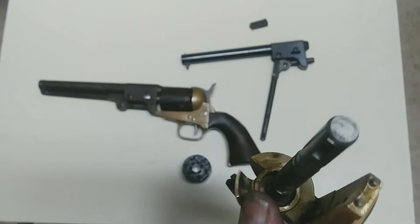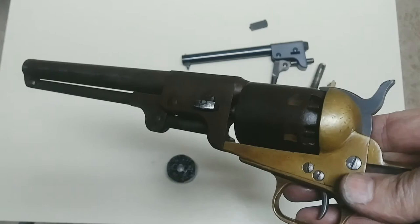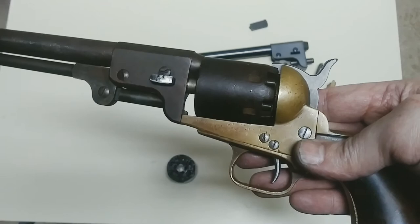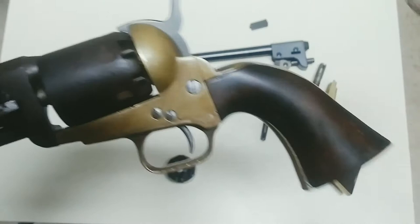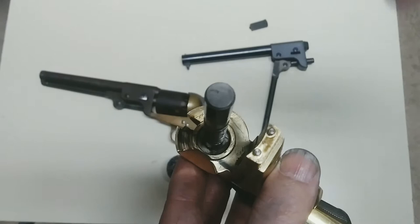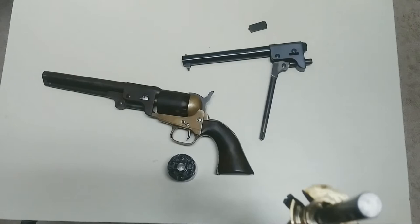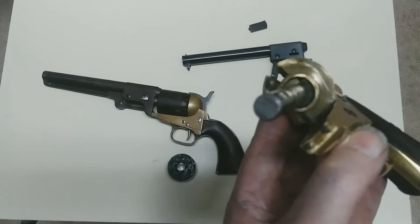Because it is an original, it's real brass, so it's shot loose. As a matter of fact, almost every original one is shot loose — I say almost everyone because there's only like two or three that aren't. This one is no longer shot loose, but I had to make a new arbor because it actually didn't have its arbor and that back piece down here. On my lathe I cut out a piece of brass — I should have maybe used steel because then it would actually last longer, I might go back and redo it — but using an end mill, I cut that down because it had its peaks and valleys from the gear. Cut it down, then measured how much I cut out of it, and I made a brass washer that went into it. All I had to do was cut one whole side of the brass washer off, stuck it in there using Loctite, and I used a couple tiny little pins so it couldn't rotate.